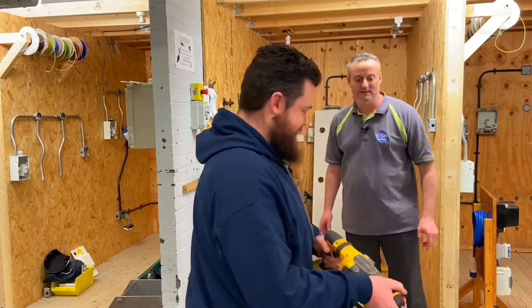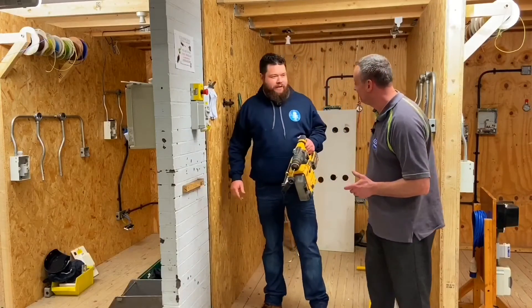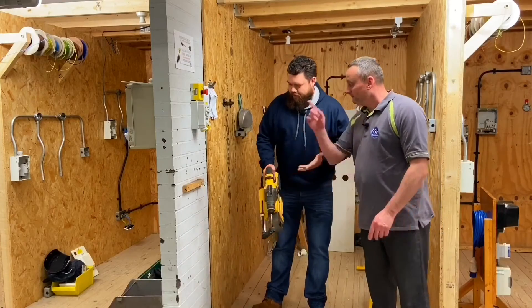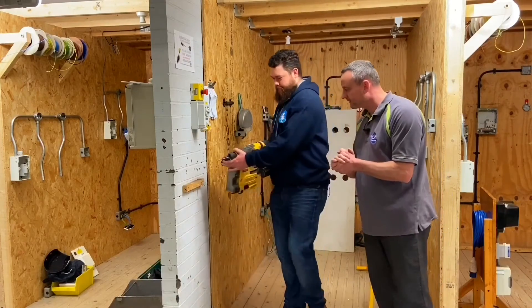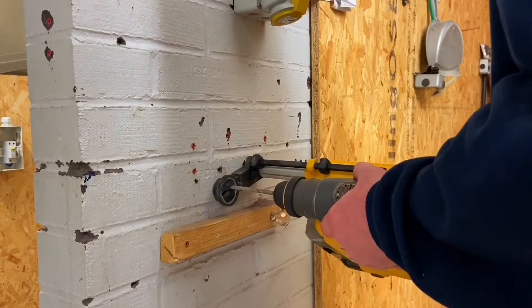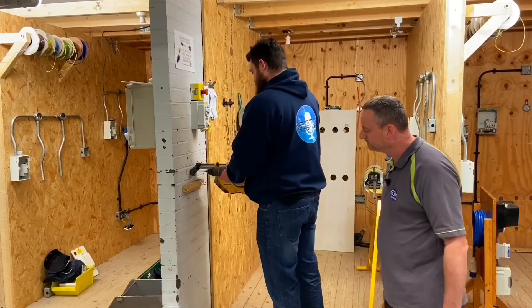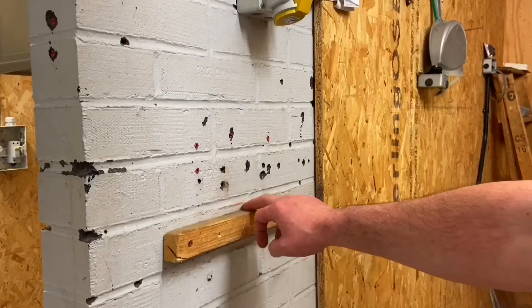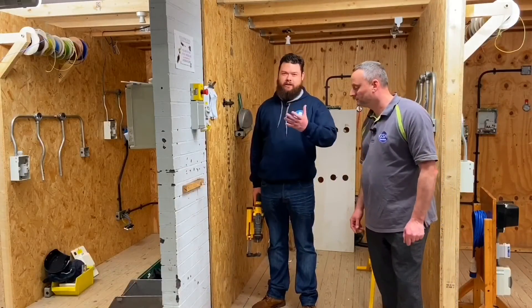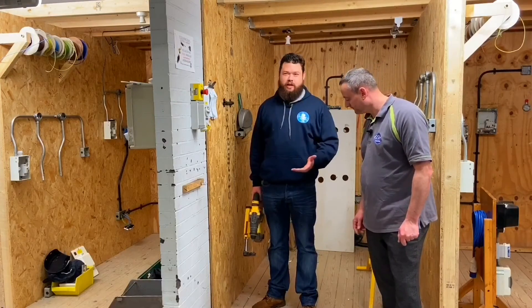Look at this! If nothing else, I'd want to walk on site just to suggest I own one of these things. You'll never get it nicked because no one else has one. People typically don't have this on site. So what you do, you mark your hole, pull that back, get your hole there, release — dust free. Absolutely dust free. And it's saving your lungs at the end of the day, especially for you young lads when you're going in at 18, 19, 20 — all your life's drilling. This is what's going to help you.